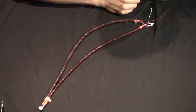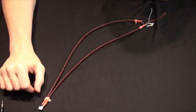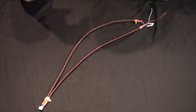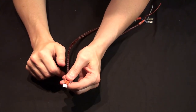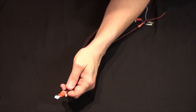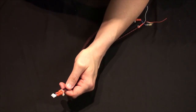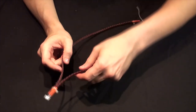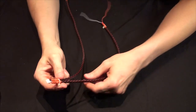I wanted to talk about the turbo button and LED cable I developed. You can actually use an L3/R3 touchpad cable and just cut off the ends and rework it from there. However, since I have the materials, I'm going to make my own. It starts with a JST 4-pin PH connector. I used red, white, blue, and black cable — they control different things. One is a pin-out: the left side goes to an LED, it needs to be 3.3 volt. The other side goes to your turbo button.